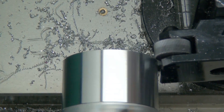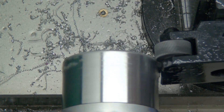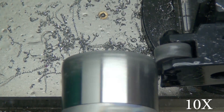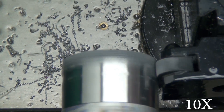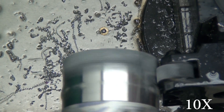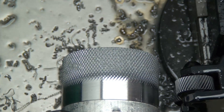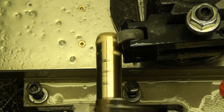I had a feeling somebody was going to ask, so I decided to go ahead and knurl a large diameter piece of work. This is almost two inches of aluminum. 40 thousandths is the depth of cut and everything else is the same: two and a half thousandths per rev, 150 RPM, using WD-40. Because the material has such a large diameter, the surface speed is much higher, which means the knurling rollers are moving much faster — but it still works just as well.